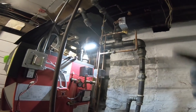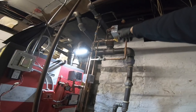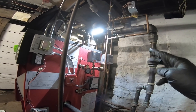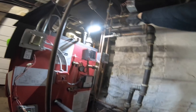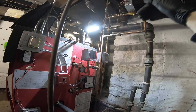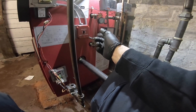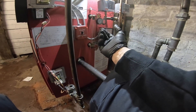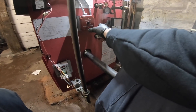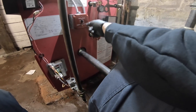Now we have an auto feed. Usually it has like a 90-second dwell, 90-second feed. There's probably the B orifice in there, which is fairly open. There are two or three different size orifices you put in here to restrict the flow, so it goes through slow. You may have it go off because you have so much steam up in your pipes — it gives 90 seconds to allow all the condensation to come back down, and then it'll start filling if it's not full.